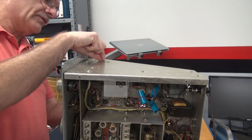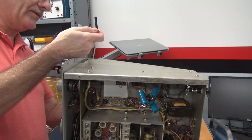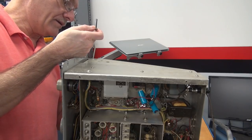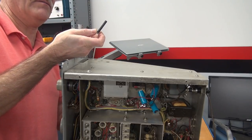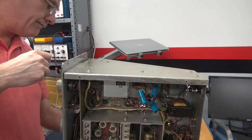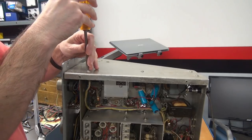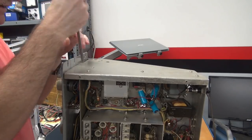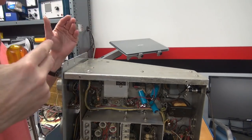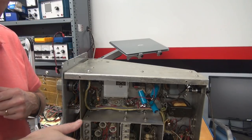Right off the bat, something interesting going on here — the shaft pulls right out of the dial drum and it's floating. I'm assuming that something is broken. Maybe this was a press fit, I don't know. I'll address that after I get this plate off. The plate should pop right off the screws, just go into the chassis with some nuts, and there are a couple of screws that come through the front. I should be able to lift this and gain access to the end of the drum and the cam's little chain drive.